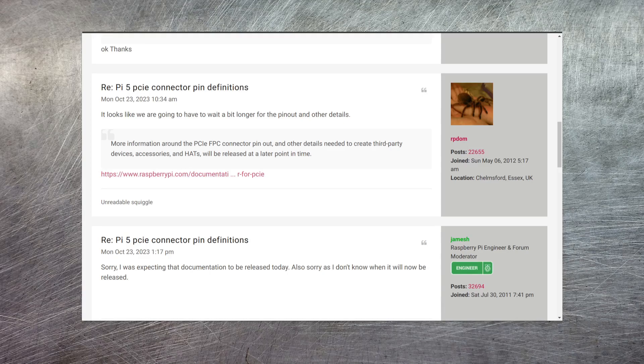However, it's not all good news. Remember the PCI Express socket I mentioned earlier? There are some fundamental problems with that. The Raspberry Pi Foundation have not actually published any specs about this whatsoever — not a pinout diagram or anything — so they're kind of actively discouraging people from trying to use it. The board is meant for makers, yet we can't make anything with it. Looking at this forum, you can see the Raspberry Pi Foundation were quizzed about why pinouts weren't available, and even they were surprised they hadn't been published. This is a real red flag to me, suggesting they're worried something could be wrong. Maybe the kernel support for the PCI Express interface is still a little bit flaky and some damage could be done. As far as I can remember, this is the first time this has happened with the Raspberry Pi — even with the Pi 1, all GPIO pins were fully documented upon launch.